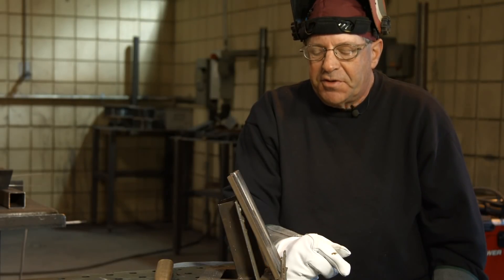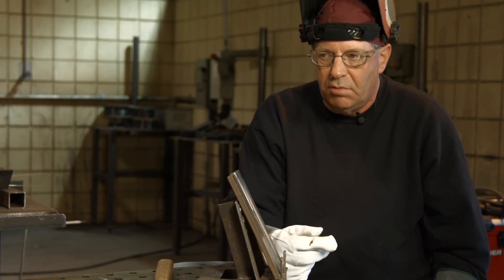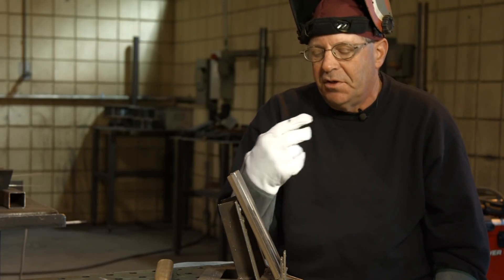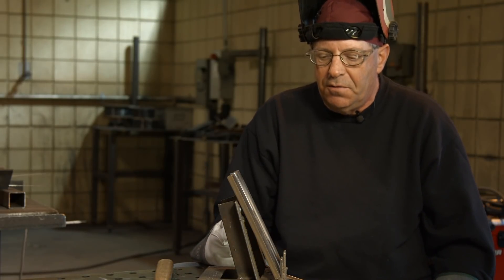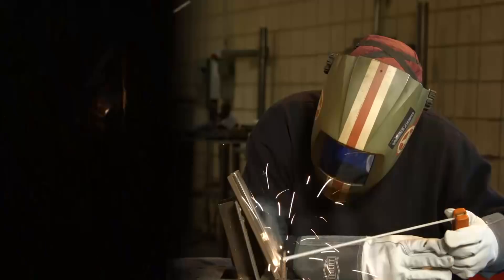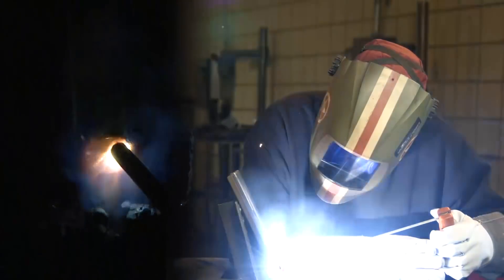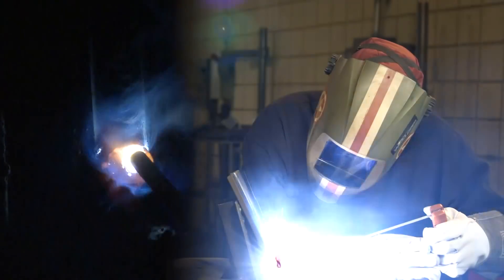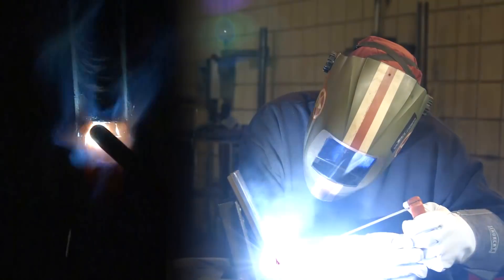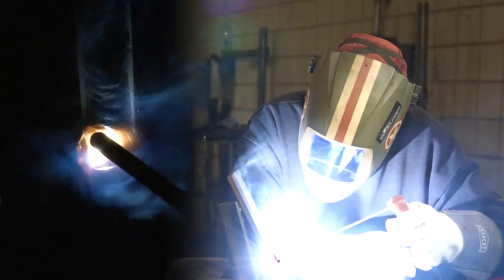I went over and dropped myself five amps for this cap. A couple of reasons: I'm fairly wide, I don't have a whole lot to fill, and my plates are heating up. I felt a little too lazy to go cool them off. If I was welding on a longer material, heat would probably disperse more and I'd leave it alone. So I went ahead and dropped it five amps. I haven't done anything to the arc force or dig — it's still sitting at 50%.